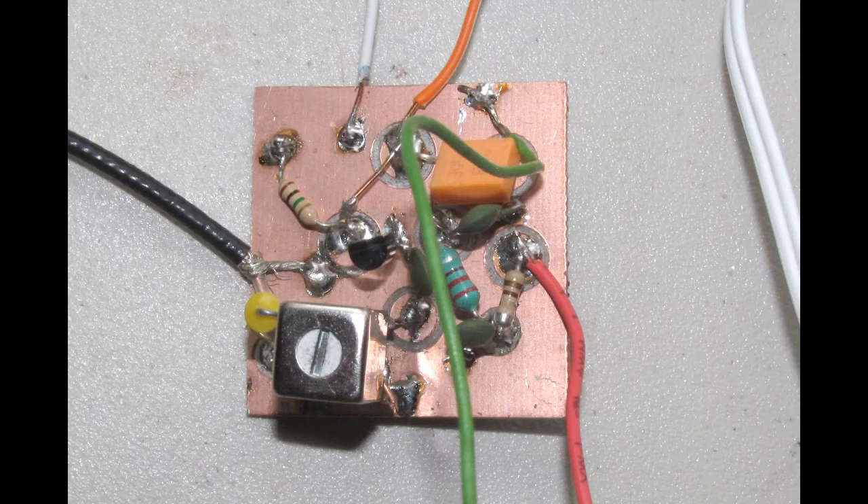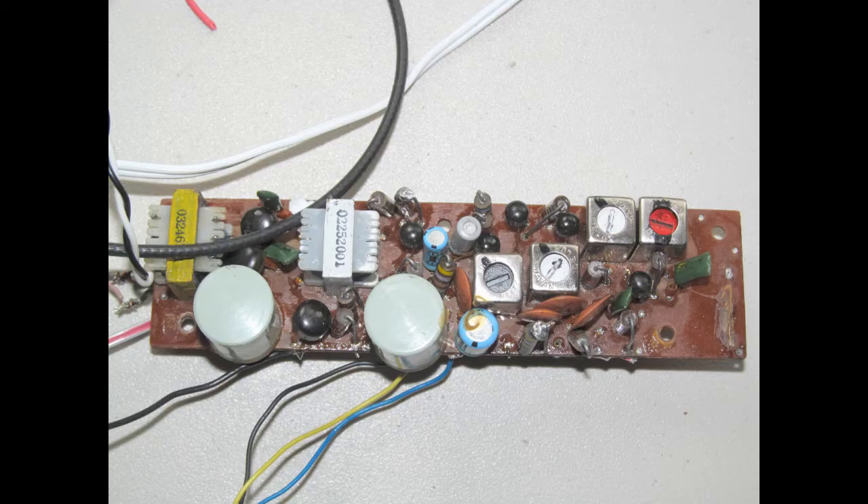And this little beauty is the final stage of the receiver — a 455 kHz IF strip that was once just a little old transistor radio I got off eBay. It's a sweetie. Any 455 kHz receiver with the front end disabled, like I show here — I disconnected this transformer — will work. This receiver also has the audio section in the back there, next to those transformers.